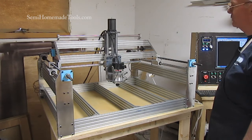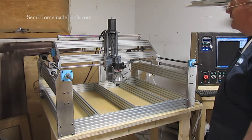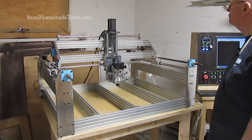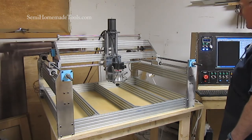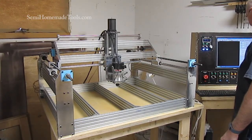We're going to get it up quite a bit from that very shortly, as soon as the new lead screw comes in. It's a five-start lead screw, so in theory we'd be able to do about 500 inches per minute. I can demonstrate what 300 inches per minute would look like, and that is on the y-axis — we do have that going at 300.